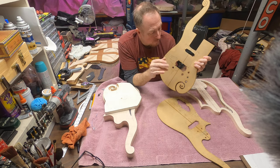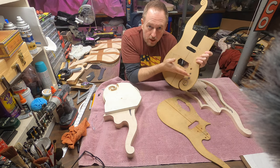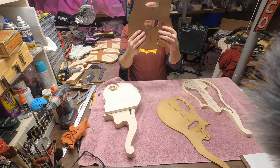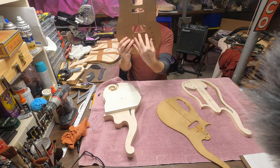So that's what I do. I had to move this down 3/8 of an inch to get it where it needed to be, so those saddles were in the halfway point of that. The other thing is that if you look at it real close, you can see from the line in the center that these are skewed.